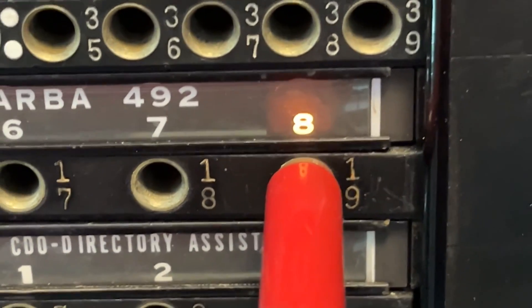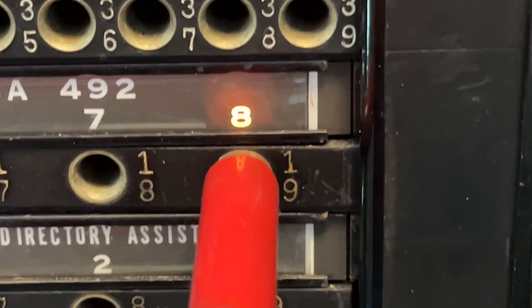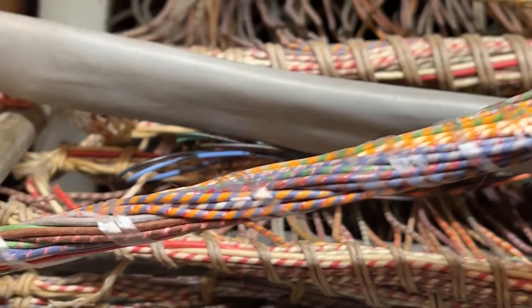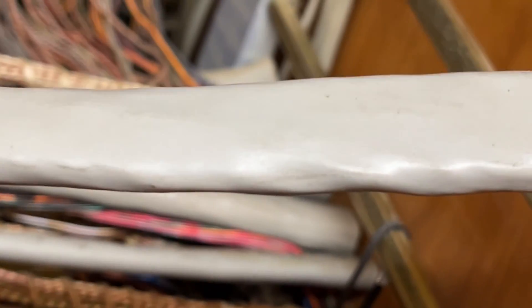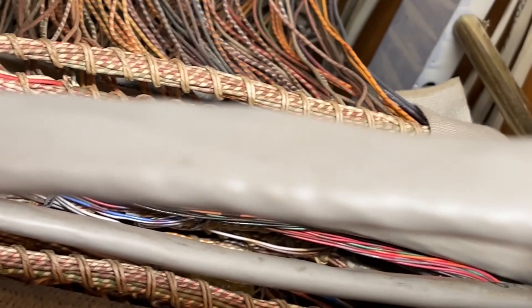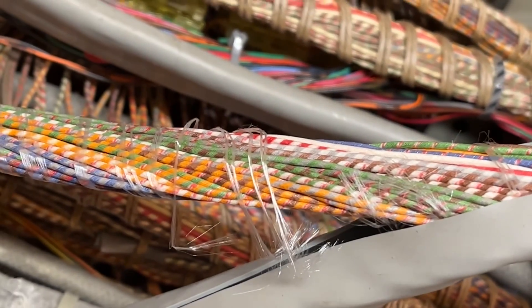One light, and the paper has eight clear and the rest of it is black, so this shows up very tiny if you're sitting in front of the switchboard. I stripped the jacket off a piece of this flat cable. It's kind of difficult to really get a good view of it. But this cable — it looks like it's a 100-pair cable, but it's actually only a 40-pair, 22-gauge. It's been flattened out — after it was made, they ran it through a machine to flatten it out. I've only seen this done on cables for the backs of switchboards.